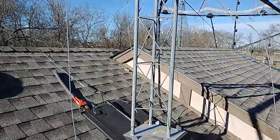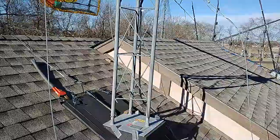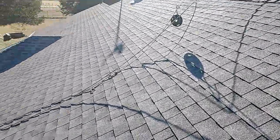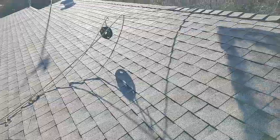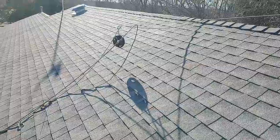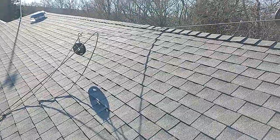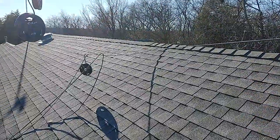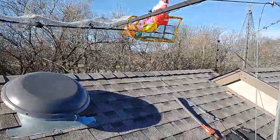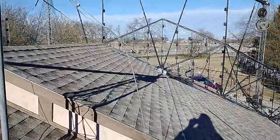The wind can really do some tweaking on this, so I've got it tied down. When you see wires and rope, that's to tie it down on really windy days — here in Oklahoma we can get some serious wind. That weight right there on the guy wire is just to pull the guy wire down so that nothing snags. You can see how close the counterweight comes over the roof and the guy wire — it's just stuff like that you learn as you go as you assemble it.